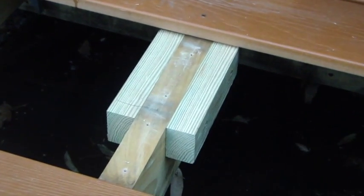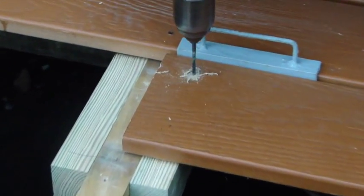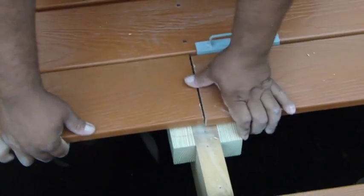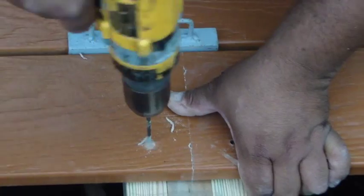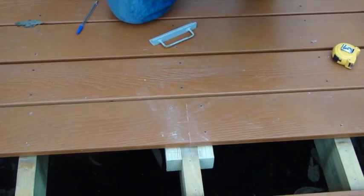In butt joints, a joist of at least 4 inches wide is required for the fastening. Remember the previously mentioned edge distances of screws. Always check with your local code authority for specific requirements. Some area building codes may require double joisting when joisting boards end to end.